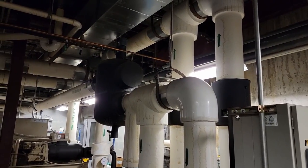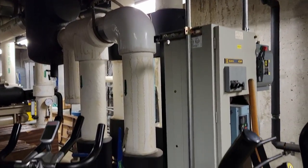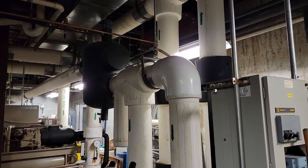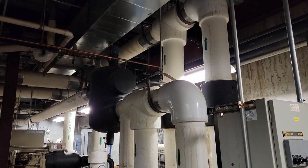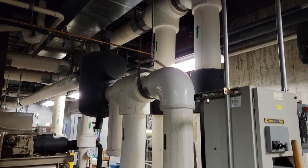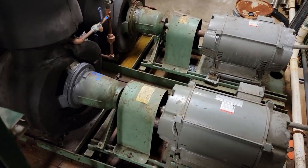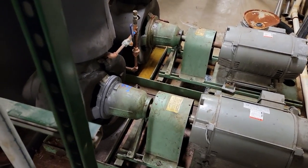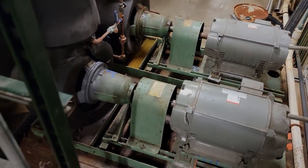Everything's been purged on the water side — any air would have gone up to the air separator on the top left. Opened up the outgoing side and shut the pumps down when I did this so there was no artificial flow to disturb it. Didn't really hear much air, so I'll probably have to go around to the different air handlers and make sure we've got cool water hitting all of them. But that's going to wrap this one up, guys — nowhere near that quick in real life. If you enjoyed it, like, share, subscribe, check us out on Facebook and Instagram, and until next time we'll catch you on the next one.